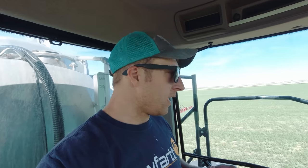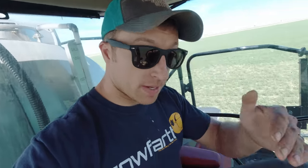It's kind of a neat sound, but it's a little noisy, a little whining. The way the power distributes between the wheels, if you're on flat ground and dry, not a big deal. Works flawlessly. You start pulling some hills, you start going on some uneven ground, they spin kind of funny. One will spin, the other will spin. There is a button or a lever on the floor that I can hit with my heel that helps lock up the wheels a little better. It'll throw oil to one wheel in the front and one wheel in the back in case you're getting in mud. That's good, but it's just not quite the same as mechanically driving the power to the wheels versus hydraulically.